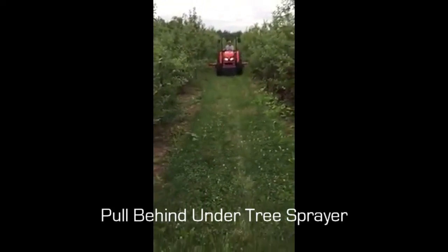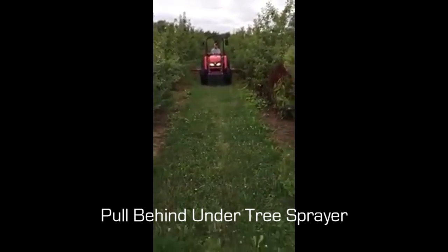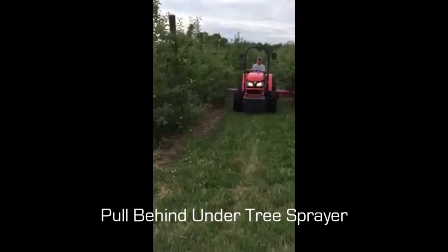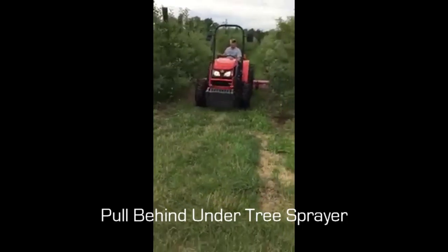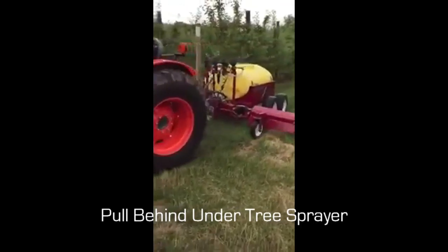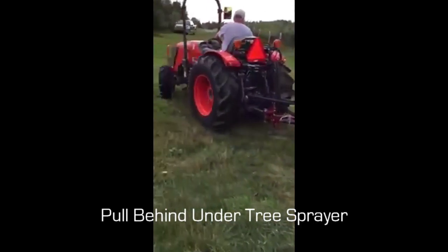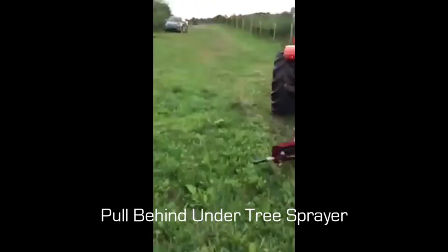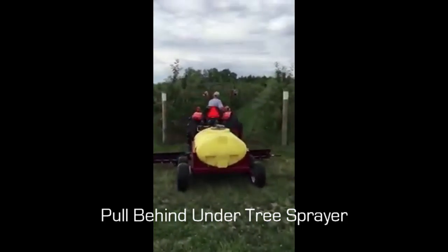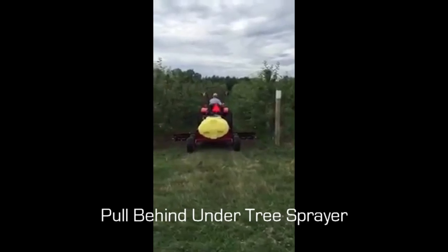Welcome to the video walkthrough of Precise Manufacturing's Pull Behind Under Tree Sprayer. This machine is available with either 150, 200, or 300 gallon tank size options, roller or centrifugal pump options, booms for either 12 or 16 foot row spacing, and the ability to be mounted on either the front of the tractor or trailer mounted.